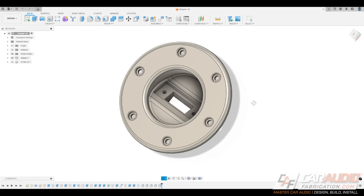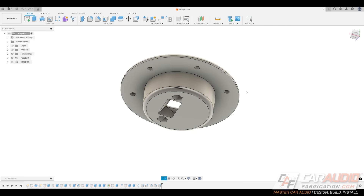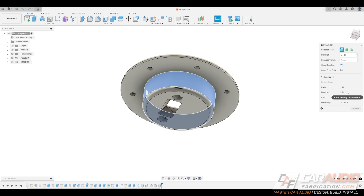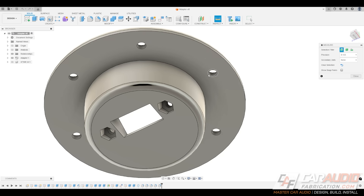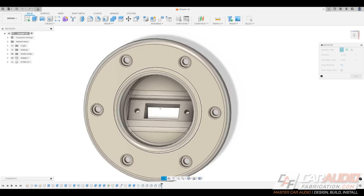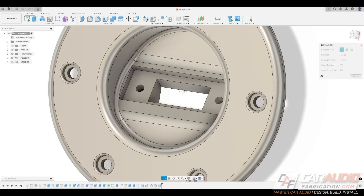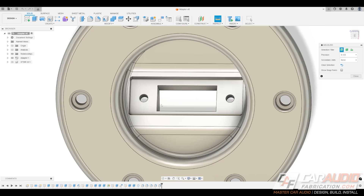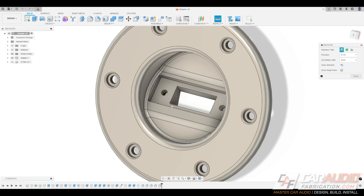Here's the design I've come up with for our plug style terminal. As you can imagine, it does look somewhat like a normal speaker terminal — being round. I've designed the diameter to be slightly undersized so it has a nice slip fit into a nominal two-and-one-quarter inch hole. The flange design is also quite large — I did that intentionally so there's a nice distance between the edge of the hole and the diameter cutout. I've also factored in the actual design of the XT90 female connector itself, which required quite a bit of measuring to get the dimensions perfectly lined up for the mounting hardware. I've also made the connector hole a rectangle so it can be flipped back and forth depending on orientation, keeping the text right-side up.